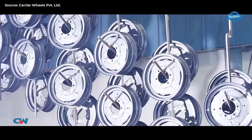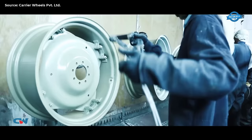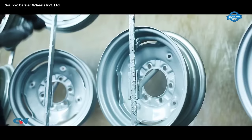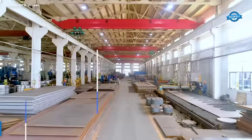The company's state-of-the-art paint shop, under SCADA control, employs a 10-stage pre-treatment method with zinc phosphating and the latest generation of e-coat paint, ensuring lifelong rust resistance for the wheel rims. Additionally, as per customer specifications, wheels can be coated with a liquid top coat in pressurized booths within a dust-free environment to ensure optimal paint quality.